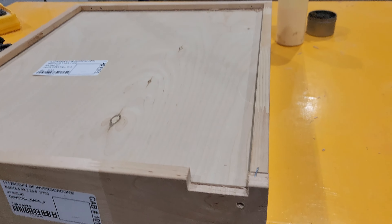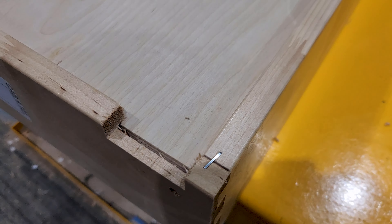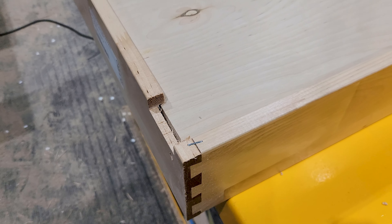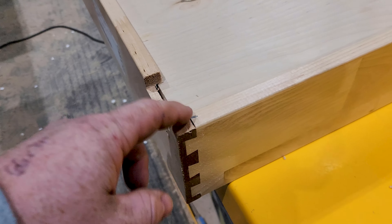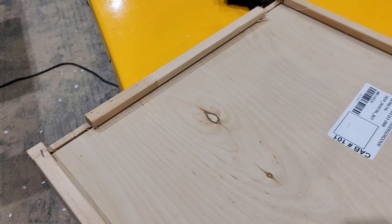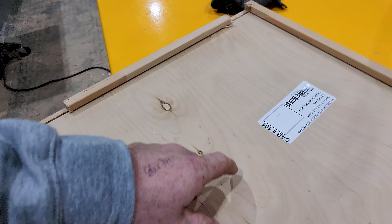Once I have it squished in the clamp, I use this stapler to staple that little back corner where the notch happens, because one of the biggest pet peeves I've had with ordering dovetails from other suppliers is that the little corner piece on the drawers always seems to pop off and break when you go to notch them. We use the half inch staple just to keep this little piece from breaking completely off once the notching happens. That's something I wanted to fix when we started producing our own drawers.